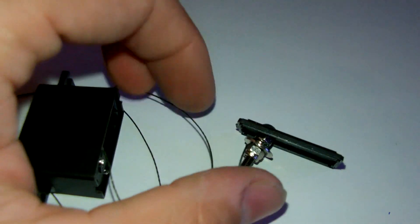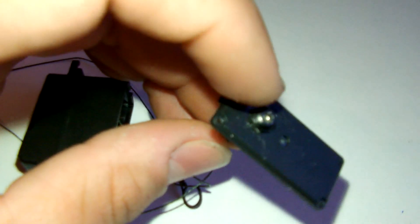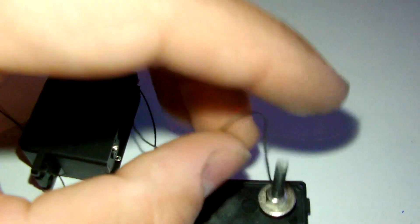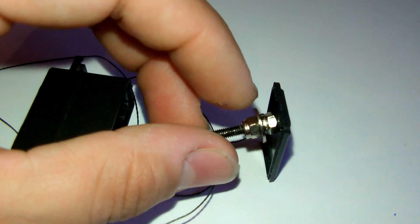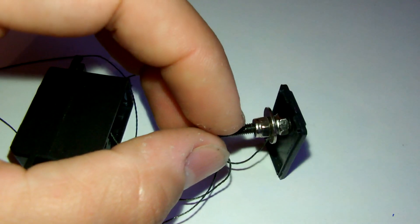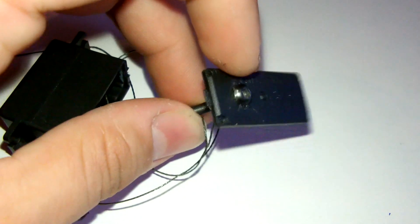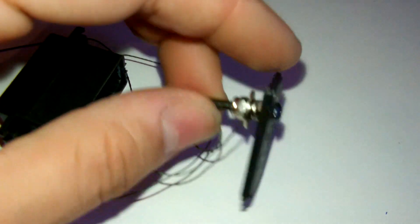The other part of this servo is this piece right here. I used a 3mm bolt — it's threaded all the way, but it just has to be long enough to reach that front gear. I put two lock nuts on it, one in front of the washer and one behind it. That washer is also going to serve as a guide so the wire doesn't wander to the other side. I put this bolt all the way out to the back plate so it's visible and easier to access — you can tighten or loosen it from the outside without taking everything apart.